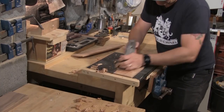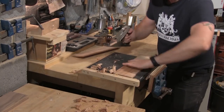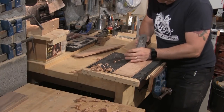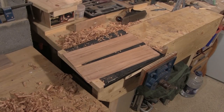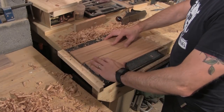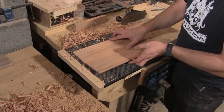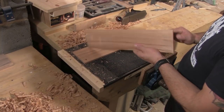I'm using my number four smoothing plane here. As well as being my favourite plane, it's also the size most likely that a new woodworker or someone with a limited amount of tools is going to possess, because it's really quite versatile. With the boards now basically flat, the next job is to make them uniform. The thicknesses are fairly close, but due to the re-sawing process one board is thinner than the other, so we'll use this as a guide for the final thickness.